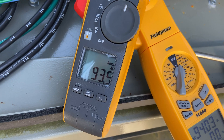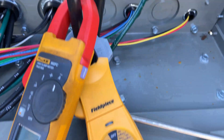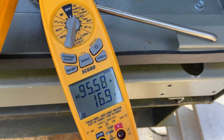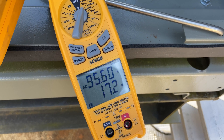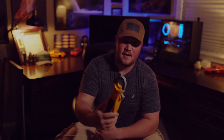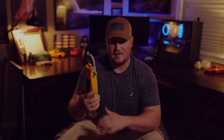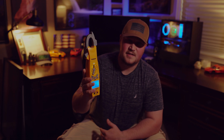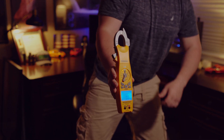So that could be an issue when you're trying to stream back through the app, which is going to give you false readings on your amp draw. Both of these meters are on the same line reading pretty comparable, but again the FieldPiece when you turn wireless on reads that extra two amps — that extra phantom voltage. That is a pretty big problem, especially when that is one of the main benefits of using it wirelessly — being able to put it behind a blower door or a panel to have that airflow by it and read an accurate amp draw. But if it's going to be off every time wireless is on, having two amps added on to an eight-amp draw — that's over twenty percent, that's a huge difference. I'll show you it does it every time I turn the wireless on, no matter what.